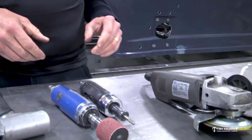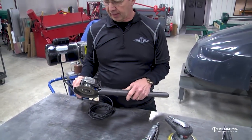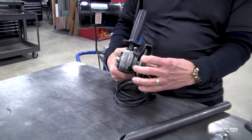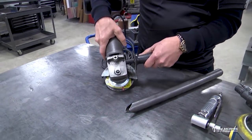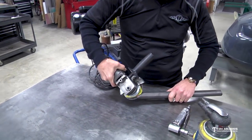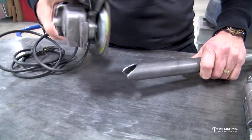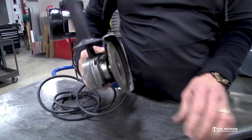This is a standard four-and-a-half-inch electric grinder. These are really common for fitting. Now this one has a used disc on it — when you put a new disc on, it's going to be really square on the corner, thick and square, and not worth much for fitting. So when we put a new one on, we'll take a scrap piece of metal and grind on that to knock that corner off and shape it. The shape on this one has been used quite a bit, but it's ideal — see how it fits in there. You can fit and grind that out and actually turn that corner to fit it. If it's got a square corner it wants to dig in and makes a nasty fit. So this is a seasoned disc but it's got lots more cutting in it and it fits in the corner well.